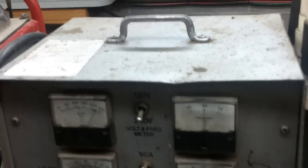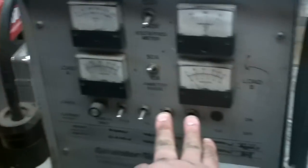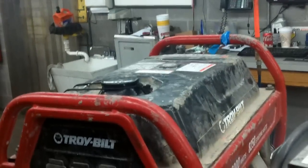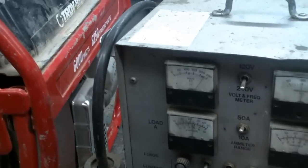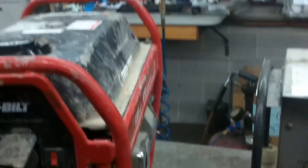When I pull a 20-amp load on it, it loads it pretty heavy — pulling 29 amps right there. The reason these AVRs go out is people overload the generator, and that's not considered a warranty issue. Now I'm going to overload this generator just for a second to show you what happens — it just falls on its face. You don't want that.